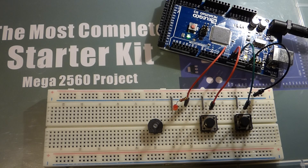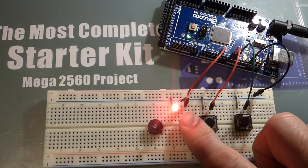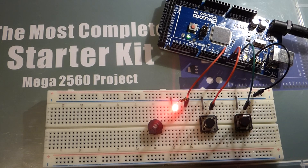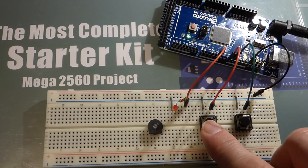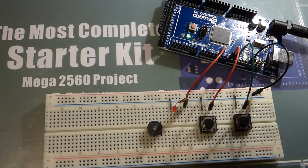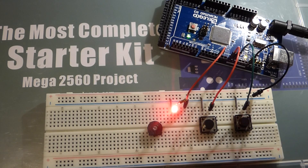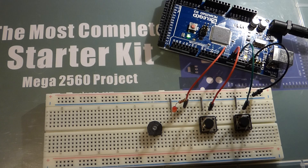In this video we're going to look at using the Arduino for digital inputs. The example circuit shows that when we press this switch, the LED turns on and stays on until you press the other switch, which turns the LED off. It stays off until you press the first switch again. This circuit has two stable states — it's stable until you press a switch to change things.